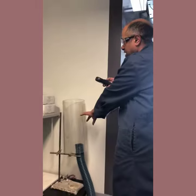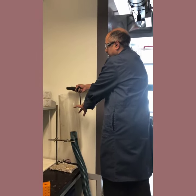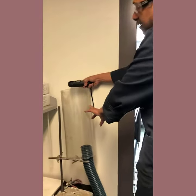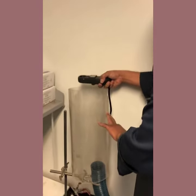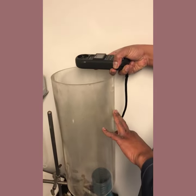To take the measurement of your stack, you take the anemometer and bring it to the center of the stack. You should be able to take your reading from the top. I've got this roughly at the center and the flow is about 10.